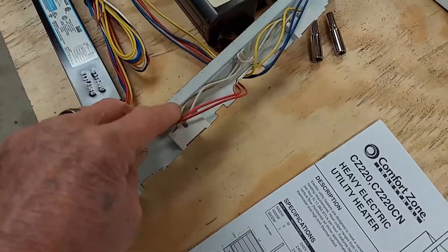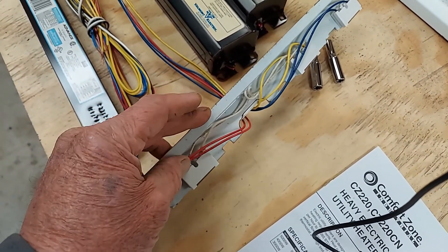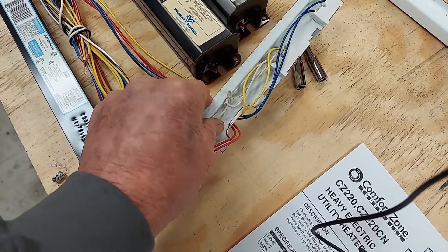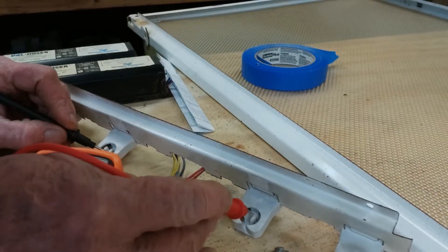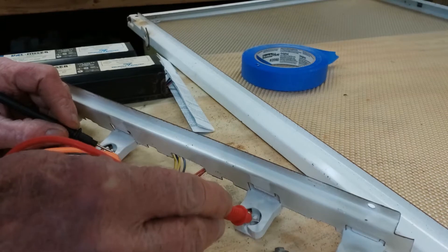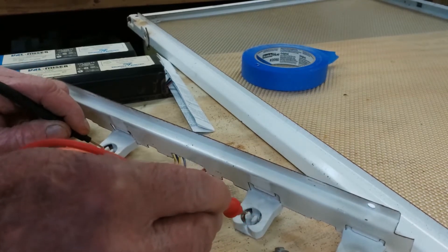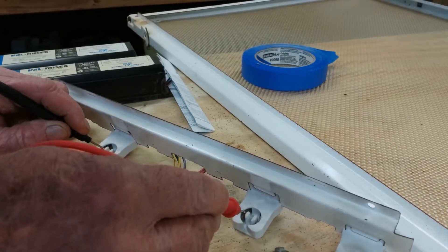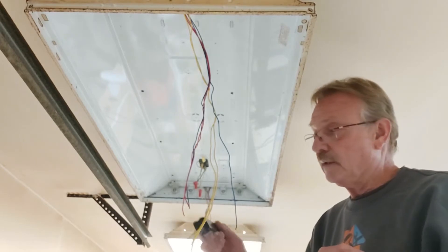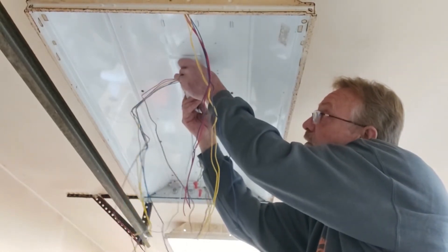As we can see here, there are two white wires connecting this lamp holder to this lamp holder with the yellow wires feeding from it. I need to take a closer look and make sure those two are jumped together and that there's no issue with these wires. Now that I have this down and I'm checking the tabs for each one, I do have continuity — so those two are connected, and these two are connected. We're good to go. I'm going to mark them and put them back up. It doesn't really matter which ballast holder you choose to put your new ballast in just so long as your power wires reach. That's why we cut the other wires right off of the ballast — so they should be plenty long.